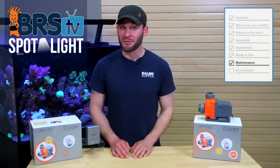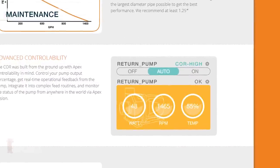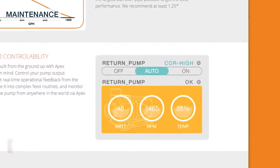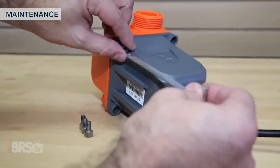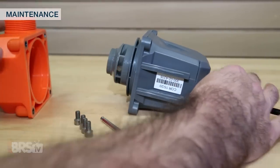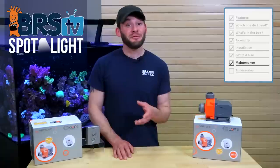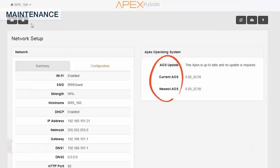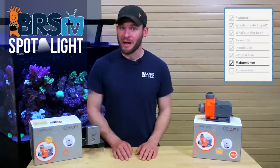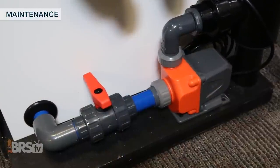Maintenance is pretty easy with the Core 15 and Core 20, especially when coupled with the Neptune Apex controller. With power draw, RPMs, and core temperature readings and alerts, you can watch for trends in the pump that may let you know when the pump needs to be cleaned. Most likely you won't need to clean the pump more than twice a year, in which case you can use the included Allen wrench tool, remove the volute or impeller cover, pull the impeller out, and clean them both with a soft brush and some citric acid or vinegar water. Just be sure the internal O-ring is in place before putting the pump back together. Also keep up with Apex firmware updates, and plumb your system with plenty of unions to allow you to remove the pump more easily if needed.